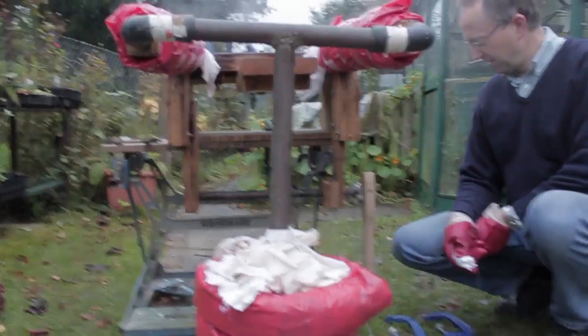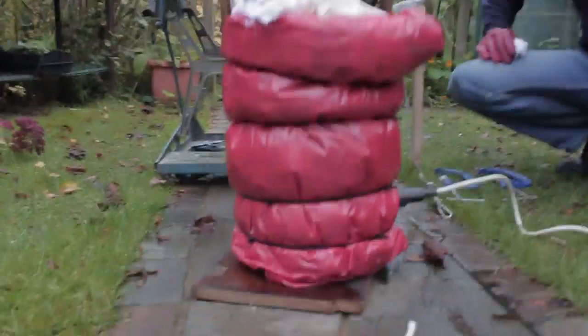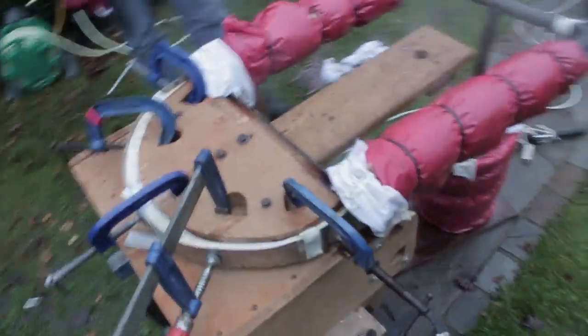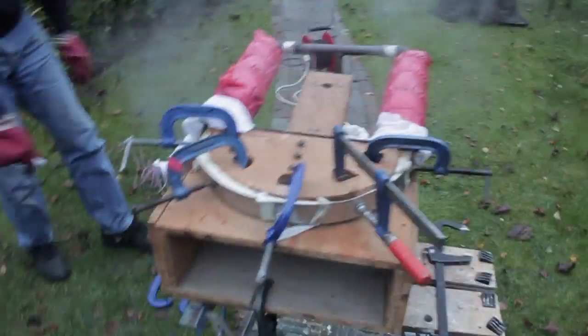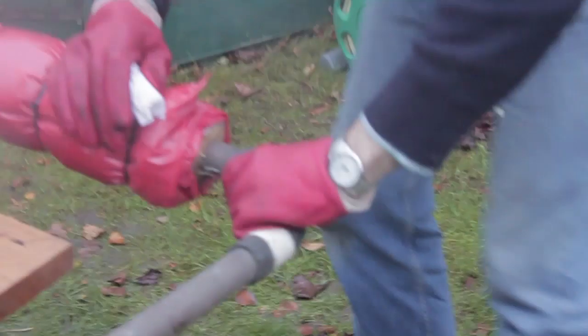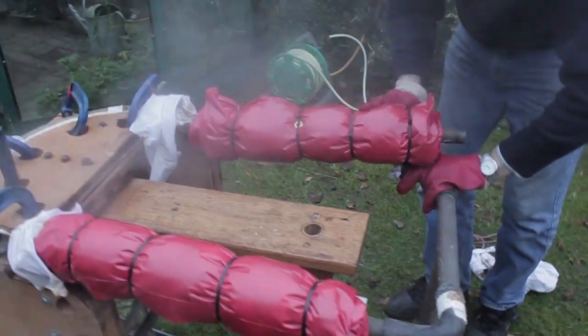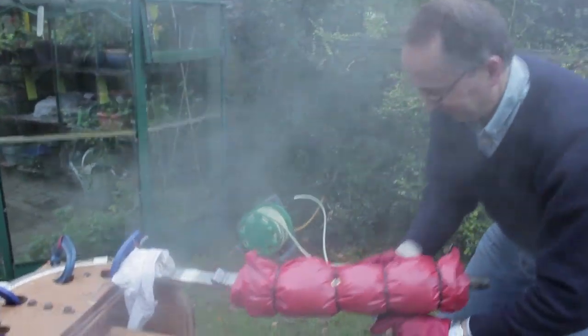The next stage is to do the second bend, which is to bend the arm sections of the chair. Here I've got two separate steaming jackets running off my steam generator, and I bend each arm individually. Here I'm just plugging up the steam feed pipe and taking off one of the insulated jackets. That bit of wood for the arm has been steamed for about 45 minutes.